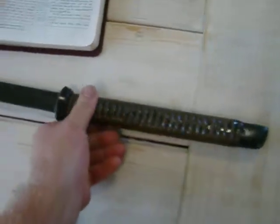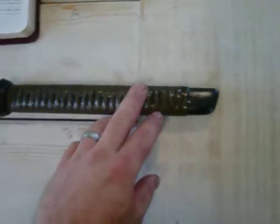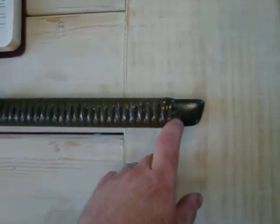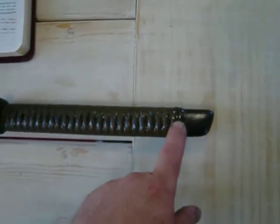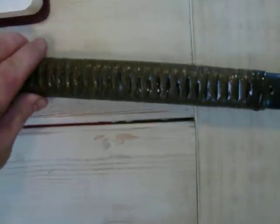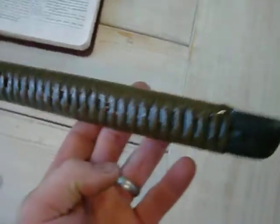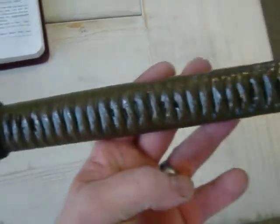Give me some basics. It is a carbon fiber handle — actually six pieces of carbon fiber that are laminated together, including the guard. The guard is half inch thick; the rest of it is just over a quarter inch. All laminated, and then three three-sixteenths chain ring bolts. It is also epoxied down, and then it is cord wrapped with some hollow Coyote Brown 550 cord. Did a kind of traditional cross wrap with the diamonds in it.